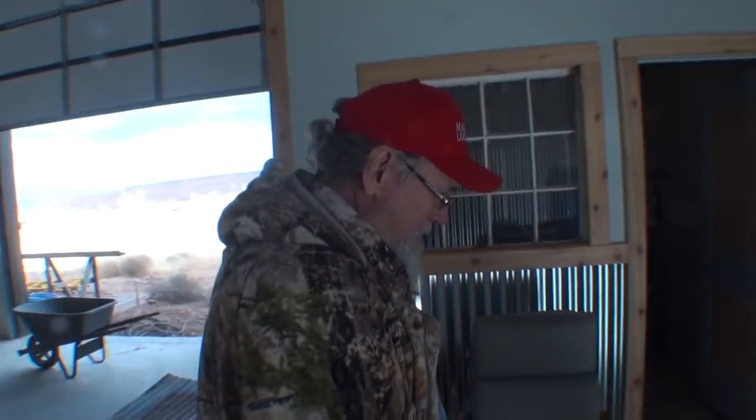Mr. Plumber guy screwed up. I just talked to your buddy, Mr. Septic Tank guy, and guess what he said? He said, it sounds like your septic tank's put in backwards. Because the arrow on top of that lid that says out means it's supposed to go out of the tank on that end, and there's a filter there.